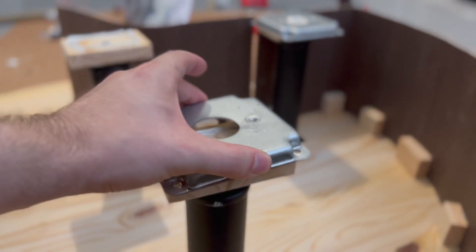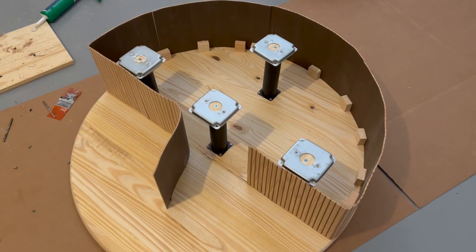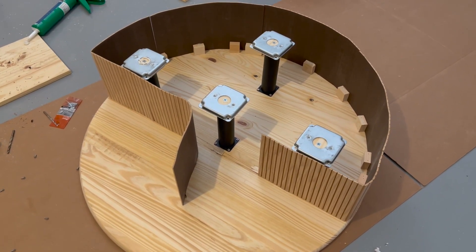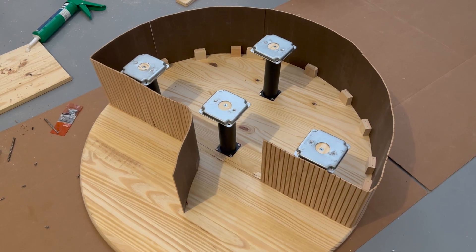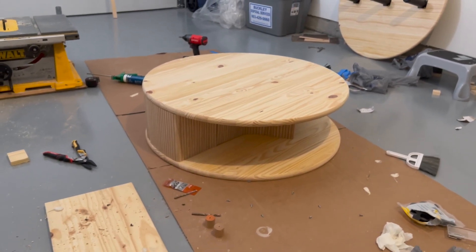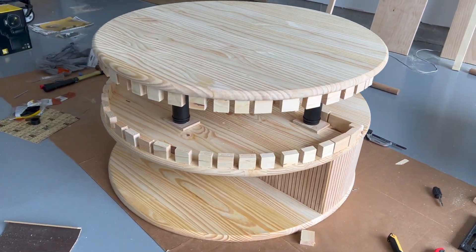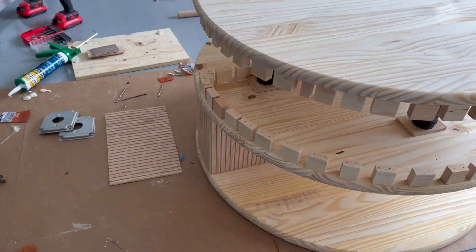Basically, we took the cap of our wood legs, attached it to a piece of wood with glue and a screw, then added a metal support to the piece of wood using Liquid Nails, which allows us to screw up into the wood round. Not the most elegant method, but it is sturdy. Then you put the middle layer onto the bottom layer, screwing up with those metal supports, and add the top piece. Make sure your supports for the top layer are on the opposite side of the bottom layer so the structure looks correct. Once done, it should be very secure and sturdy.